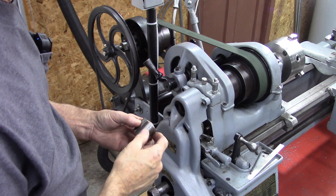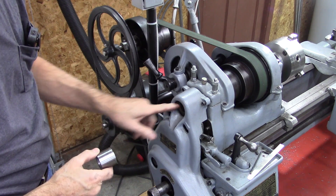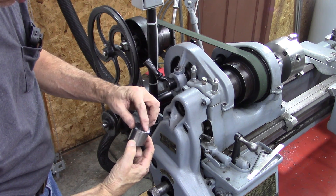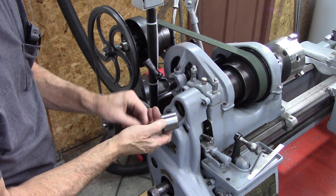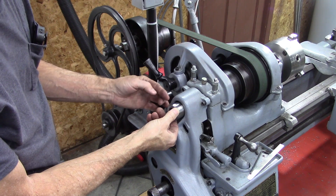Right here, I don't want to interfere with using my bore, so I don't want to put anything inside it. So I'm going to bore this out a little bigger and slip it over the end of this gear right here, then put a couple of set screws in it and embed that magnet right there. Then the prox switch will be mounted right here and read that magnet.